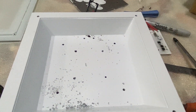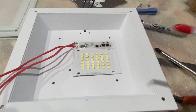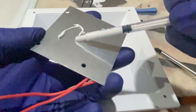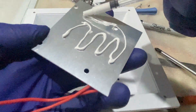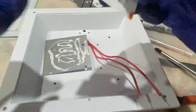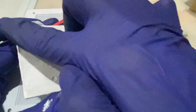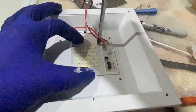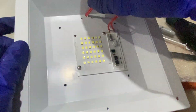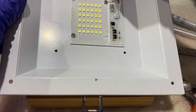I clean the surface thoroughly, then apply thermal paste. I get more thermal paste onto this small area to make sure heat is properly dissipated through the casing. Since they provided only a small amount, I use additional thermal compound and spread it to get a thin even layer. Then I use two standard steel M2 screws to secure the module, making sure it has good contact so heat can be easily lost through the heat sink.